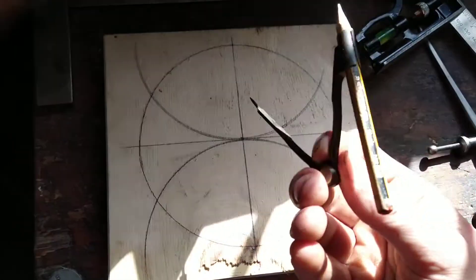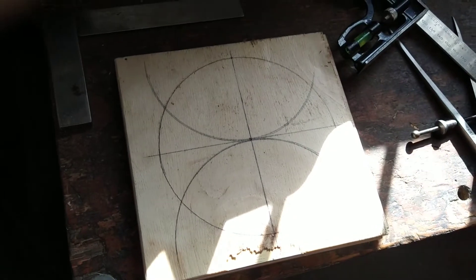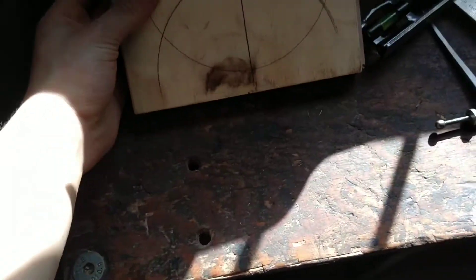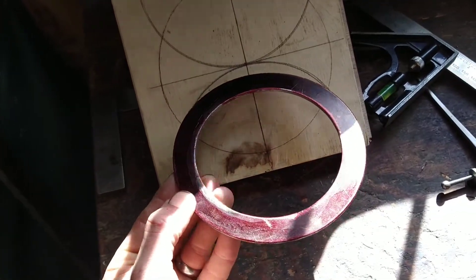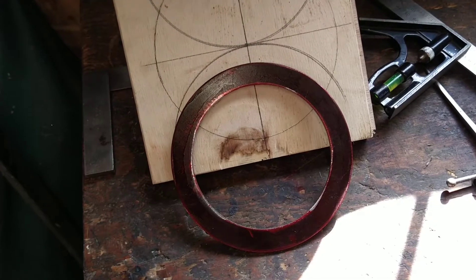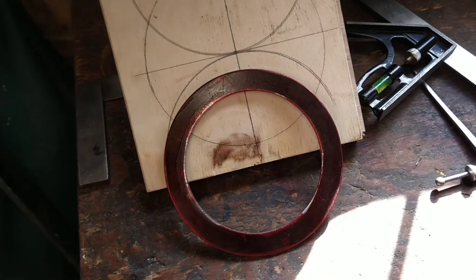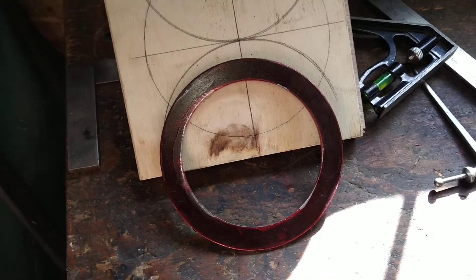So I've done my divisions here using my little antique compass - I picked it up somewhere, like an older steam rally or something. These are all marked out now and I'm going to transfer them onto my wheels, onto the rims. I'll use these to line up my spokes and drill them for the rivets.